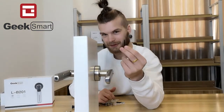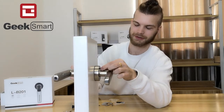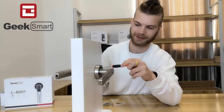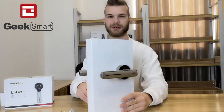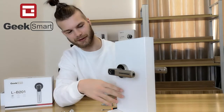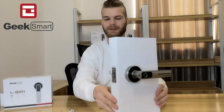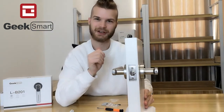Take these connecting screws and fasten the door handle to the door — insert the top one, then the bottom one, and fasten the screws. The door handle should now be correctly installed. To check, turn the exterior handle — the one with the fingerprint scanner. The latch should not withdraw. Now try from the interior side; the latch should withdraw. Good.